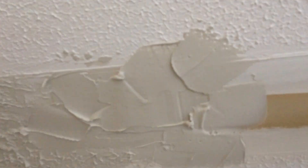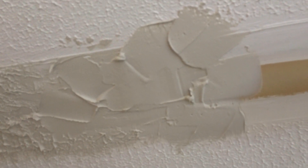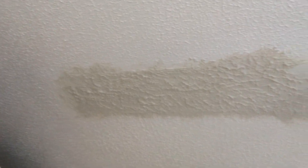Because I've put the light in, I need to try and match the existing ceiling. I'm just smearing some filling compound across there - I'll show you how to do the Artex in a minute. There's my attempt at a patch. I think it'll be okay once this filler dries - it dries white, so we'll see what it's like tomorrow. It looks a bit odd just now because it's a different colour.